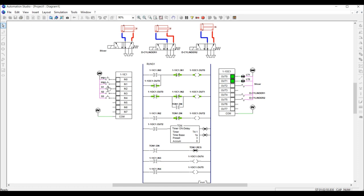When sensor one sends a signal, the conveyor belt automatically stops and the slicer starts slicing the pepperoni for three seconds. That's why I placed a normally closed contact linked to input two, which is sensor one — when sensor one is triggered, this opens and cuts the circuit, stopping output one, which is the conveyor belt. A normally open contact also linked to sensor one energizes output two, which is the slicer.